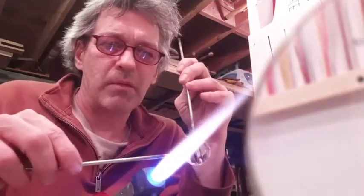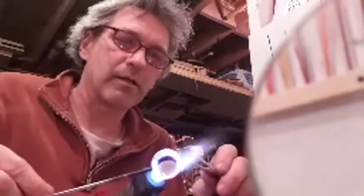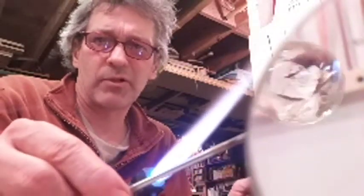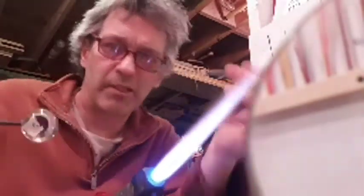And because I'm sort of overheating it, I can pull it out and bring some glass with it instead of pulling just this out and leaving a bunch of weird glass or metal oxides in the glass. I just went in there and made sure to pull out anything that even looked suspicious. And since I overheated this, I quenched it. I'm going to heat it up again. I just want the tip to be hot, not an inch or two down the rod.